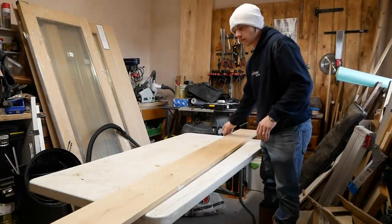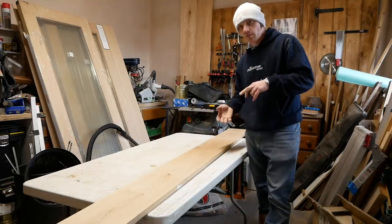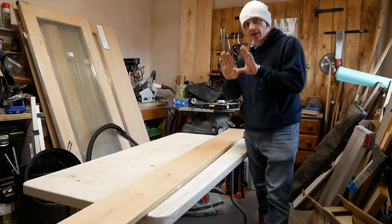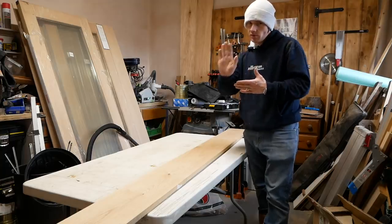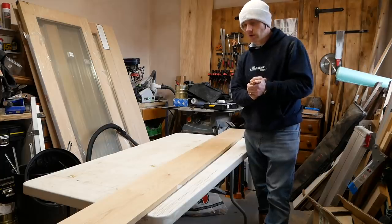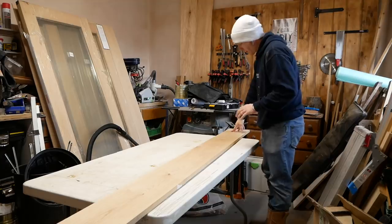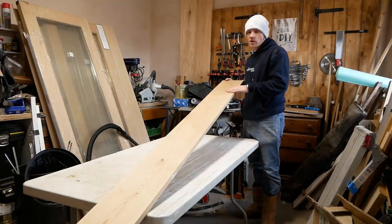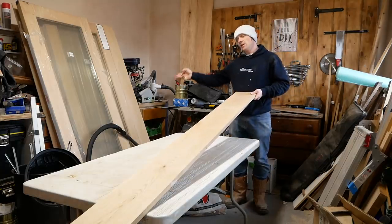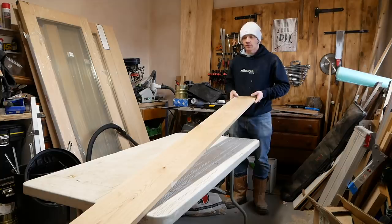Right, we're slowly getting there with our pocket door project. The door is in, the hardware is pretty much there. Now I'm going to be installing two bits of door lining either side of it, so hopefully it sits flush and there's almost an invisible line between the two, or a shadow line at least. So I've picked up a length of white oak, which is very similar in grain to the end of the door, so hopefully things are going to match up fairly closely.